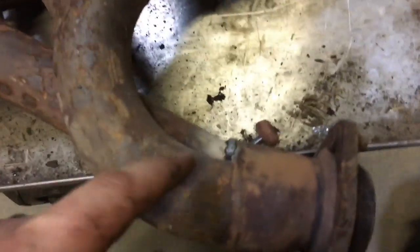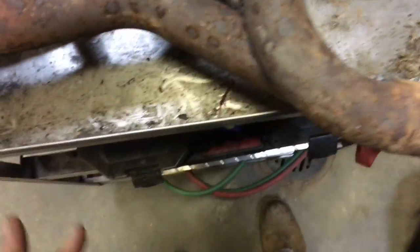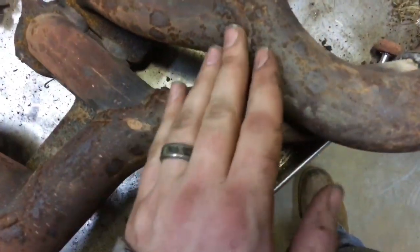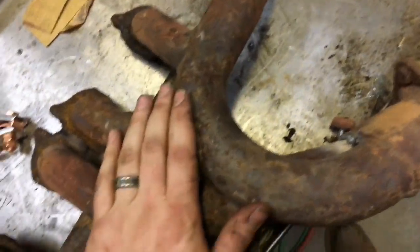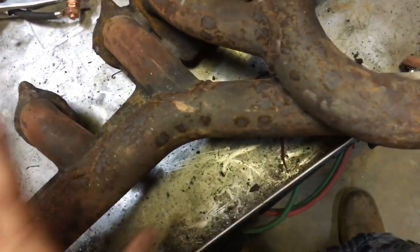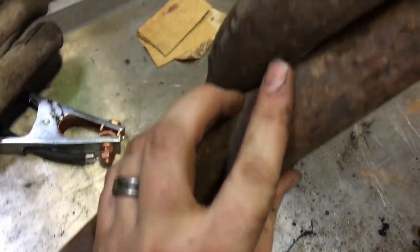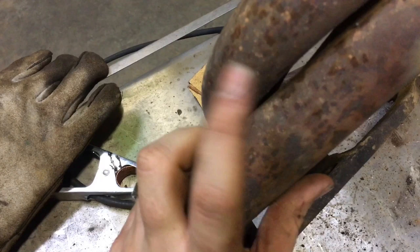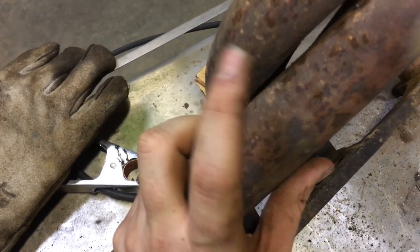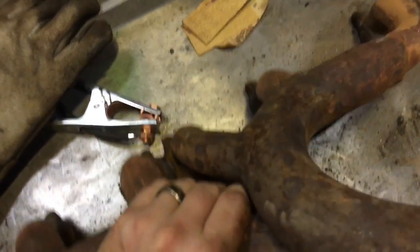All right, now we got that piece welded and this piece is welded, so let's talk about what we're going to do next. I went ahead and went over this off camera — there's no more cracks in this thing whatsoever. It's not hard to save these. After you get all the cracks drilled and welded up, here's what you want to do: put a bead right here to keep these pipes from flexing back and forth. You can get a piece of flat stock and put it across there.